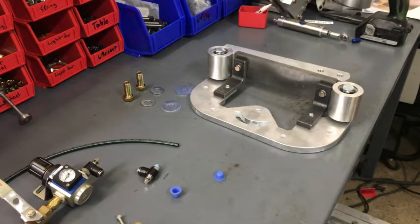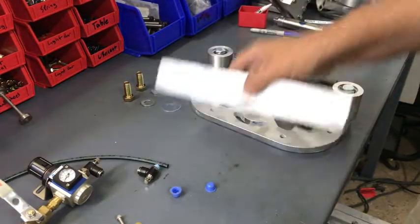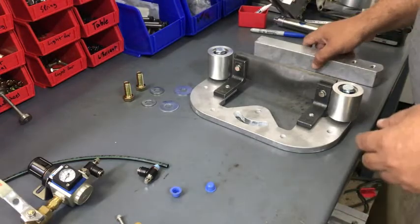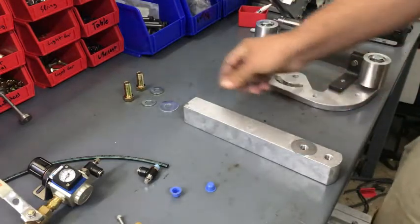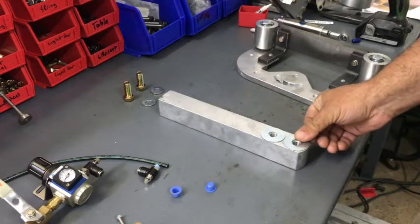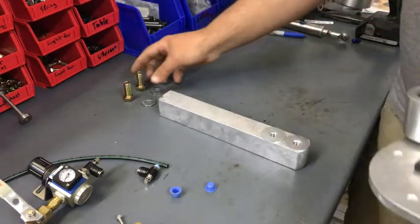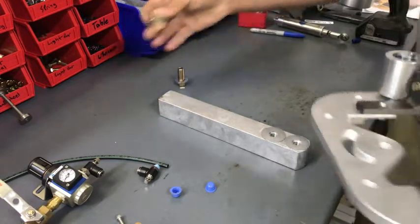The platen. When you get the platen there should be an arm for the platen, a couple of bolts, and four washers. This goes together a specific way and there's a reason for it. These big, very thin washers are spacers that are required so that you don't end up with problems later on. The big diameter thin washers go under there as a spacer, and then these are just normal nuts and bolts.